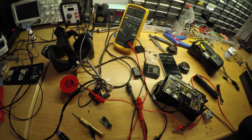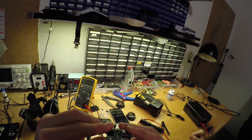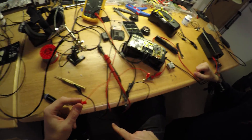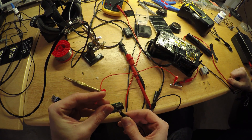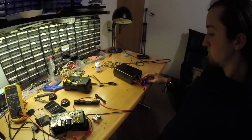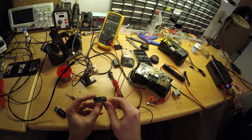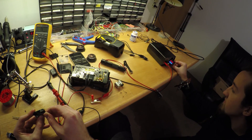I ended up desoldering everything to get a good look at that tiny circuit board. It has a DC barrel connector for the 5 volt wall plug adapter in case your USB power supply is not strong enough, and a sync output for the camera module that's recording the infrared LEDs. USB communication only works from one device to another and the data lines are going through this board untouched as far as I can see. But USB mini plugs have five pins, so one extra connection, and that can be used to send the sync signal from the Rift back to this tiny intermediate board. It also freaked me out a bit that they connected the red and black wires directly together but used the shielding for the ground connection — probably to handle a little bit more current.